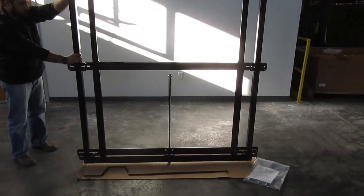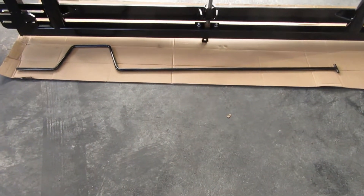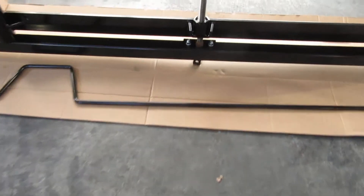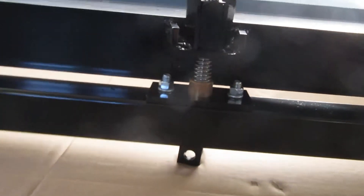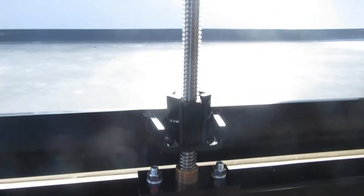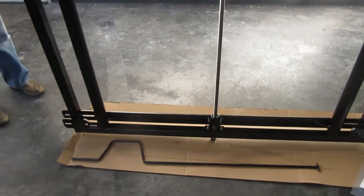The unit comes with this removable crank handle that you see here, and that removable crank handle engages this clevis at the bottom of the height adjuster, which allows you to turn the clevis, which rotates the screw, which actually makes the backboard adjust up or down.